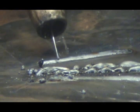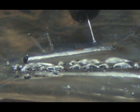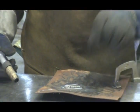That sounded a lot better. See the difference? That's pretty. This is a little high right in here where I may have been moving a little too fast, but this was starting to sink down where I slowed down a bit — and that's where the extra voltage was starting to penetrate into the metal. You can hear the difference in the sound.